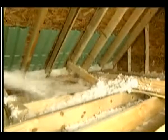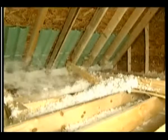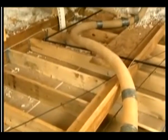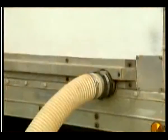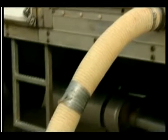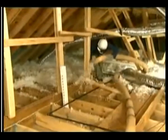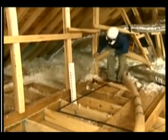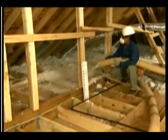Be sure to get insulation to the top of exterior walls and low places, but don't cover the eave vents. For best results, avoid tight bends or kinks in the blowing hose anywhere along its length, but especially near the blowing machine outlet. This prevents the material from compacting in the hose. Also be sure the hose is free of leaks, which reduces air pressure and can prevent the wool from fluffing to the proper density. Repair leaking hoses or patch the leak with duct tape.